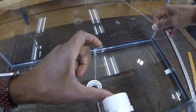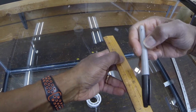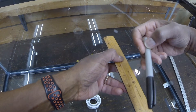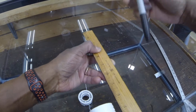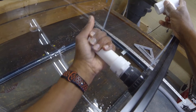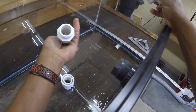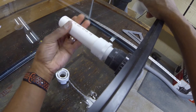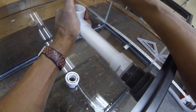Then we'll have a pipe coming off of here — this looks like 3 and a half inches. So we've got to go 8 and three-quarters minus 3 and a half, and then we need to add a half inch on either side to accommodate the fittings. We've cut our horizontal pipe for the solids lifting outlet. We've inserted that into this adapter — it's pretty well stuck in there now. So that slides in here, and this T fits over the end. That lines up pretty well with the center point of the tank.